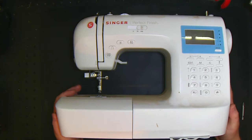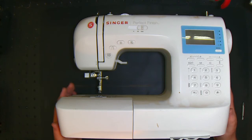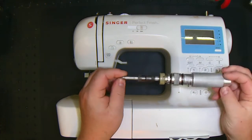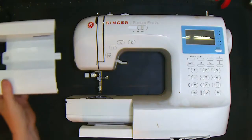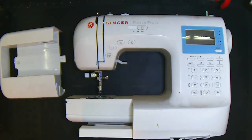see what's there. And whenever you're taking something apart, usually the best thing you can do is just start with what's visible. Find screws. If you don't know if they're case screws or whatever, just start with those. And although I won't be using it today, I have set up my torque limiting screwdriver. Just if you ever want to put stuff back together and have it stay together, you want to make sure that the screws are properly torqued. One of these little guys will get you there.